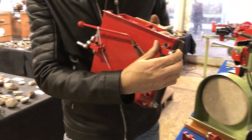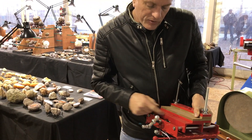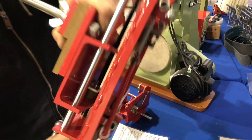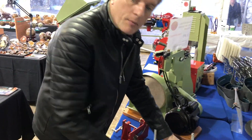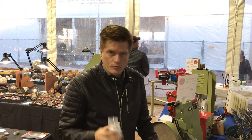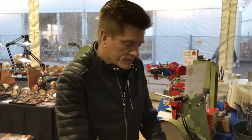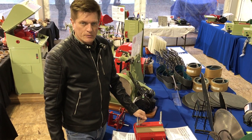We've taken out a new roller block design — got rid of that crazy angle iron thing they did. It's got a fine thread crossfeed, just like the bigger saws, and there's also a brass nut. If you look underneath, that's a replaceable brass nut, just like the big Highland Parks. So you can take your old Lortone, drop a new carriage in there. We're actually going to do a video of an LS-10, and other than fixing the arbors — since we use a pillow block bearing — you can get your old Lortone to operate better than a new saw, because the precision, since we CNC line bore them, is far more precise than anything available on any of the old Lortones.